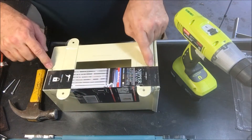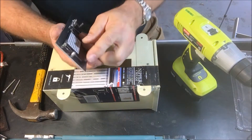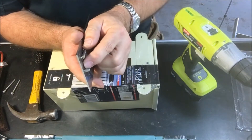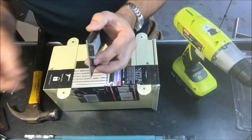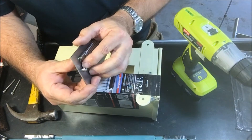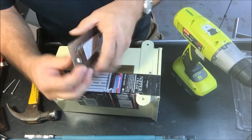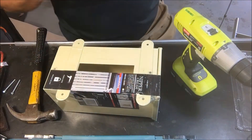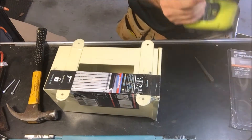Now we're going to need to repeat the 8mm hole in here as well. These are designed to go into brickwork, so normally you wouldn't have to bother, but because we're only going through a very thin sheet of metal, the mounting hardware is actually much deeper than the thickness of the metal, so these holes need to continue into here. So again with the 8mm.